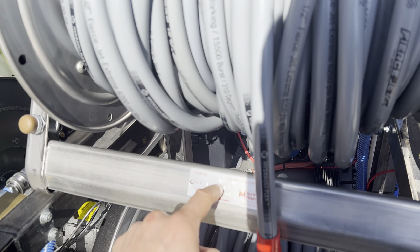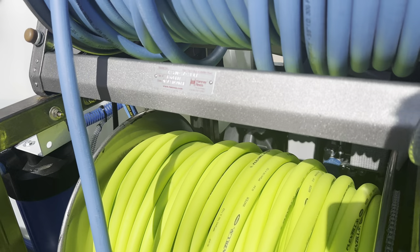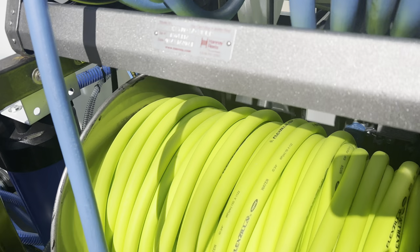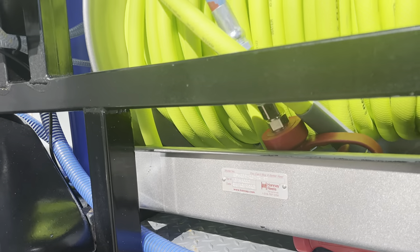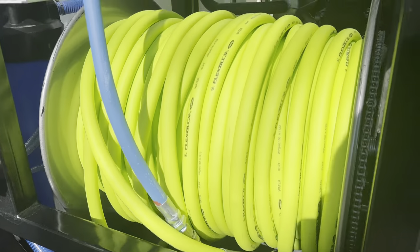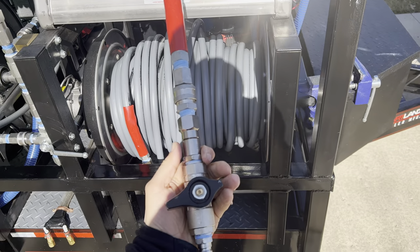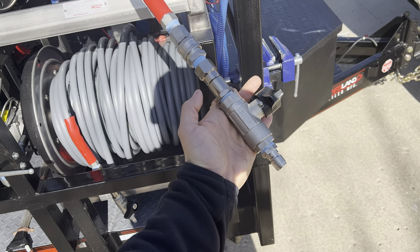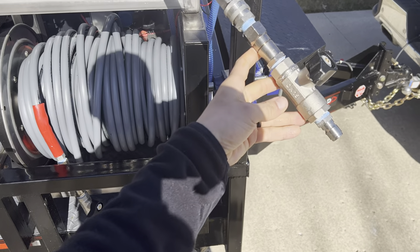The two pressure reels are the SNC 18E models. The soft wash reel is the E15 30 17 18, and the giant monster water reel is the EP 60 30 23 24 RT. At the end of my half-inch Fierce Jet hose I have a DN15 ball valve — the 15 is the half-inch model, the DN10 is the three-eighths model — along with a full-flow swivel and half-inch quick connects all around.